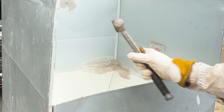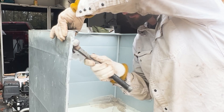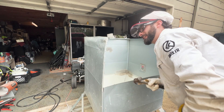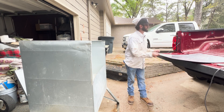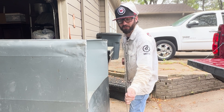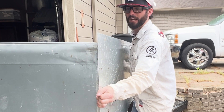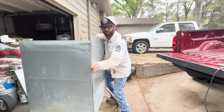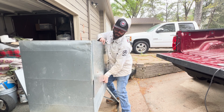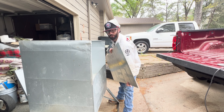We'll go ahead and take our mighty manipulator here and just want to help kind of line up a few things before we try to fit up this other piece of sheet. I'd like to see some of those waves and wrinkles taken off, but it's okay - we're going to cover a lot of these problems. Now I'm just going to pull a couple quick measures. Obviously this sheet is a little bit excessive for what we need, but it was cheap - a drop piece from my local metal supply. This sheet of 18 gauge only cost me around $18. All we want is for that edge to line up properly, but we do want about an inch and a half of lip on the top so that we can fold it over just like these other sides. We only want maybe an inch down here of overlap.